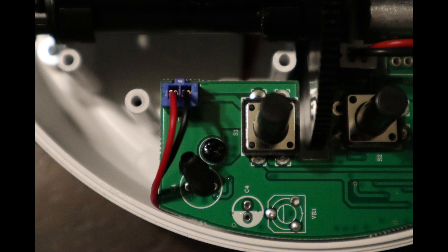Knowing that my hack worked where I just held down the button, I took a multimeter and toned out the switch itself to figure out what contacts were making connection when I was holding down the button. Then I decided to go ahead and solder new connections to that button trace and wire it to a button that I can use to override that electrical connection.